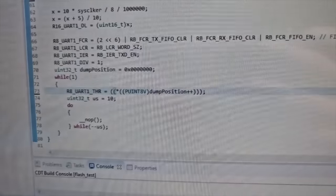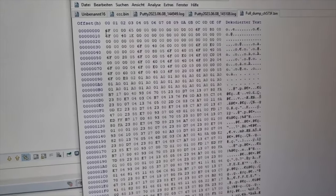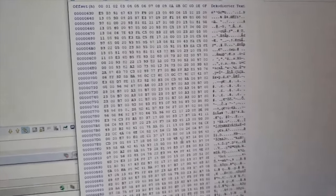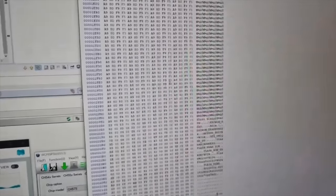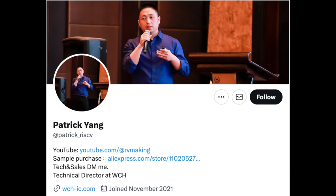What Aaron did was write a very small program. All it does is read the flash memory and dump it out of the serial port. When he reprogrammed the device — the only way to get past the security features is to erase it and write new firmware — he found that after dumping a little blank space, it actually dumped all the rest of the code that was in the device. It didn't actually erase the whole device; it only erased a small portion to write his code, and the rest of the code was kept. When he published this, Patrick at WCH, who's a technical director, reached out and let him know: actually, this is a feature.